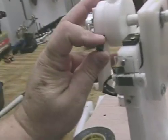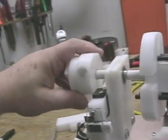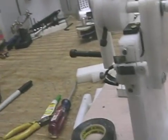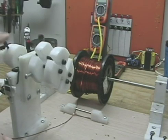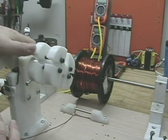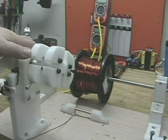The way this is designed, I can actually pull this off and put a drill on it if I want. If I'm winding something that I can run real fast, I can do that — it pulls out and comes out perfectly straight. And what I did on the winder is I marked it with that black line. That's the fat side — that's the back side of the coil where the leads come and are tied together.